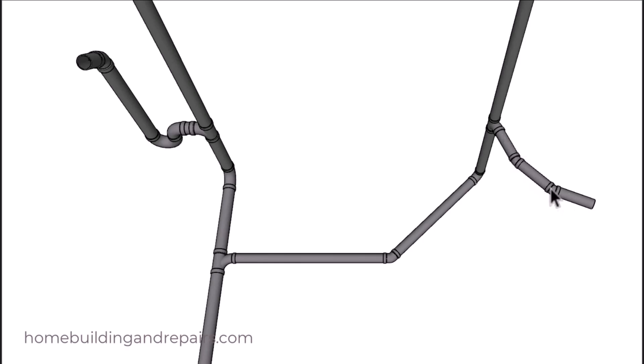This line here will need to be an inch and a half. So we're going to have a sanitary tee fitting with an inch and a half over here, two inches on the top, two inches on the bottom. However, you could use a fitting with a two inch bottom, an inch and a half side outlet, and an inch and a half coming out of the top — and that's normally what I would use to hook up a kitchen sink. On the wash machine, we're going to have a two inch long sweep 90, then come up to a two inch sanitary tee. You can have a two inch coming out of the side, two inch at the bottom, and an inch and a half coming out for your vent. Then we're going to use a trap and then come up with a 45 to finish the connection for our laundry drain.